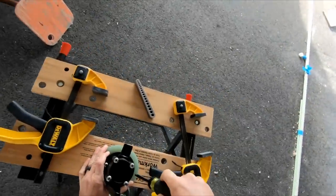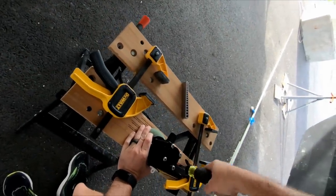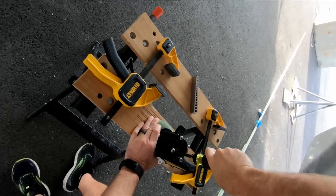Both holes have been drilled and tapped. Fingers crossed that I got everything just right and it's all going to fit. It's not 100% perfect, but it's good enough that it all fits together — and that makes me so bloody happy. Really, really thrilled that's all coming together. There is one thing missing though: a giant hole in the middle for the actual through hole to fit through. I found it a little easier to start with the entire backing plate without the big hole drilled, just because it makes it easier to get my measurements. So I'll go ahead and drill that hole now.